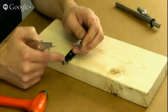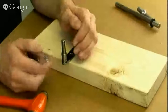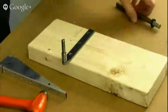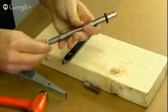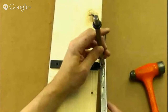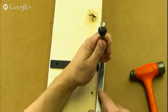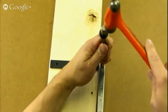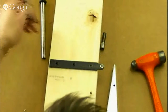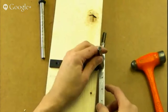Our male dies are spring back, and this has the spring back angle also. You need pretty good hits to get the back angles completely engaged. I actually prefer the RAM for the C-frame where you can hold it so you can really feel that it's straight up and down. Sometimes this takes an extra set of hands to hold the part, but then you can strike it a few times on top to make the dimpled impression.